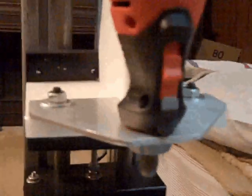What I did do — I ground this down. This is a plastic nut underneath here. I ground it down to where I could use that aluminum plate there to support. I wanted to get it as close to the spindle nose as possible to support for lateral loading on that tool.